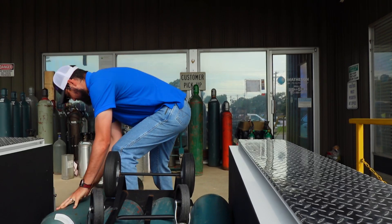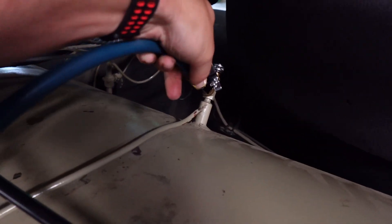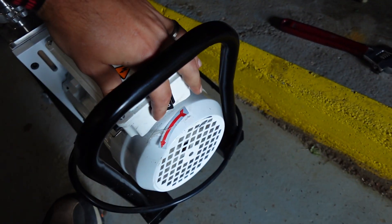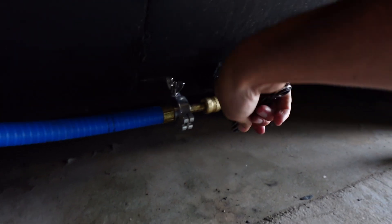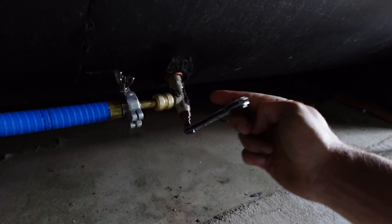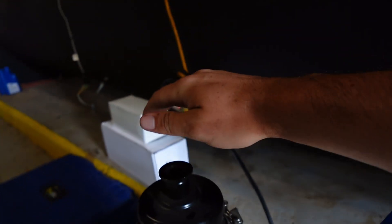Looking at this, we decided to do a triple evacuation on the system, as it looks like it may have gotten moisture in, or there was a heavy moisture load from the leaks. After isolating the vacuum pump we charged nitrogen back into the system through the top of the condenser to help break the vacuum and prepare for the second pull. After breaking the vacuum, I made sure to use my gas ballast this time on the pump — it's not something I've had a good habit of using in the past.